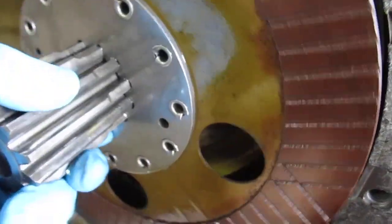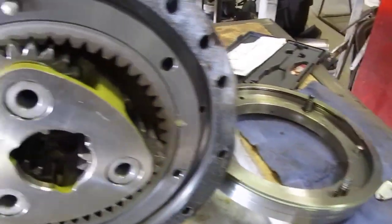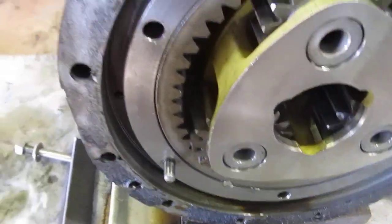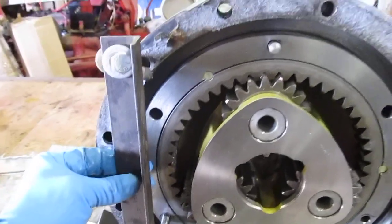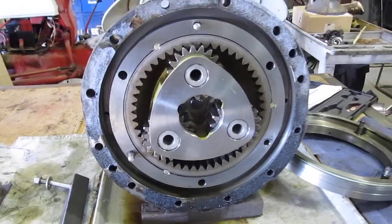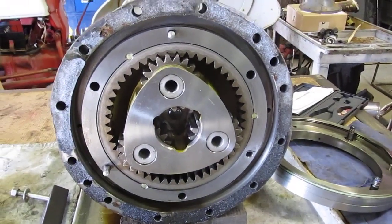All your parts will be available at your local John Deere dealership. The installation of the piston can get a little tricky — make sure there are no burrs where the pistons ride before replacing it. Simply take some angle iron; I used bed frame in this case. I made a simple tool, one for each side.